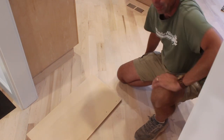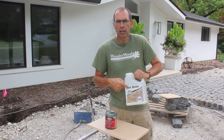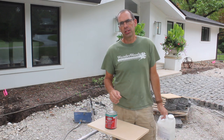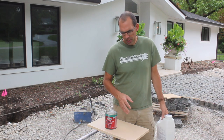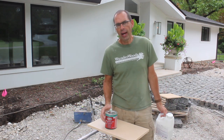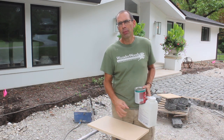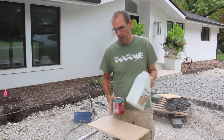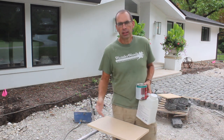I finally got the finish the way I like it. I'm using raw sealer from Basic Coatings — the reason I'm using this is because it's the exact same stuff the flooring guys use, so I know the sheen and color will match. It also has a little bit of white in it which helps kill the yellow cast already in the panels. I also added some white latex paint — not much, just a little bit — to the finish so when I spray it it's more of a whitewash. I was having to put five or six coats without it; now it's coming out really nice.